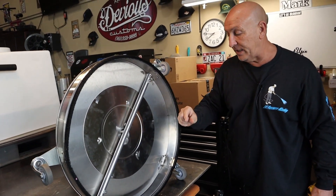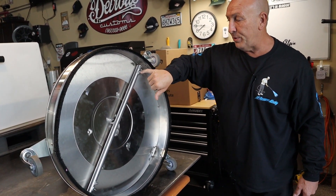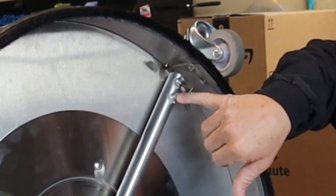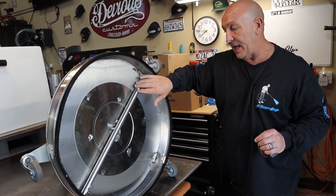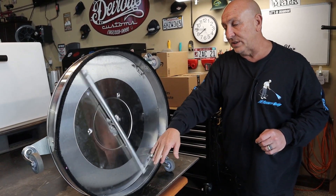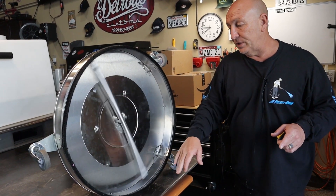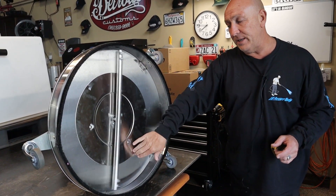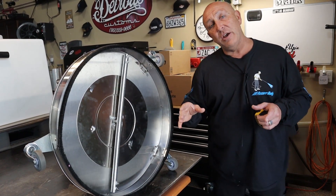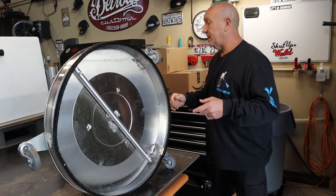Now you're an inch and a half off the ground. I put 40-degree tips in there, so that's a wider fan. We left the pusher tips — these are what you call pusher tips, they're like a zero tip and they help push the bar and spin it faster. That way it's not going slow and putting lines in the ground. With the pusher tip it spins faster, you've got a 40-degree spray, and now you can walk at a normal pace. That's what we do to soup these things up.